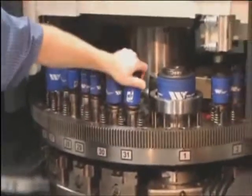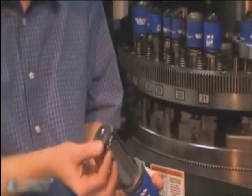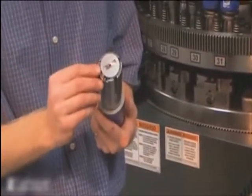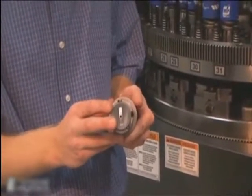The new HP series — the upgraded series — retains all those benefits. The guide snaps off, the stripper plate slides out, and we have added some grind life to the punch tip and enhanced the tool steel on the punch itself.